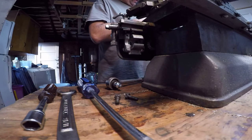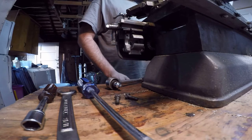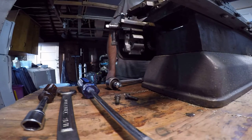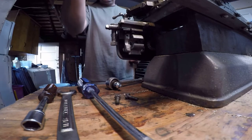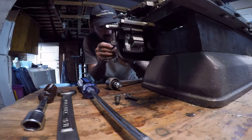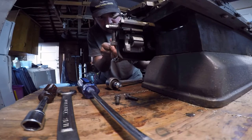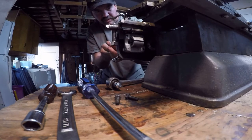Slide the carriage off the end. Okay, we've got that. Now loosen the spring tension. I should have shown you this before moving the camera, but I'll show you where that is in a minute — it's right here on the front. There's a little set screw that goes in there; there's a spring and a ball detent in here.